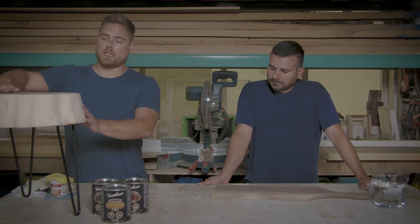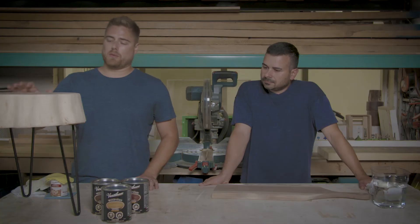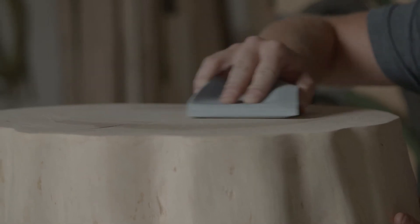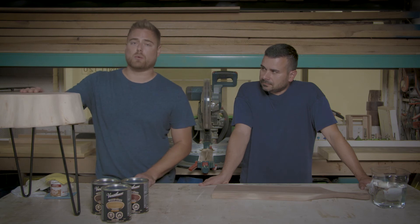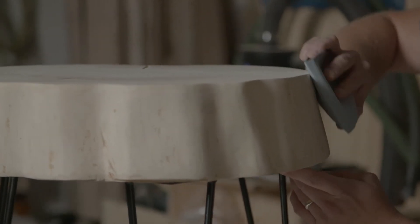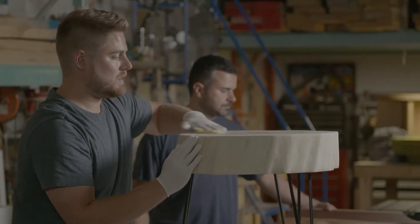To achieve smoothness on a piece of wood like this one here, you want to start out with an 80 grit sandpaper from the raw state of the wood. The 80 grit usually takes you the longest because the wood really is rough when it's first cut. Then you move up in grits — I go up to 120 next and I finish with a 220 grit. That really does give you the ultimate smoothness for the stump and it prepares you for the staining.